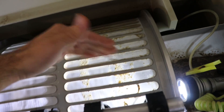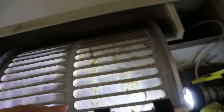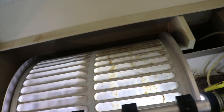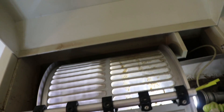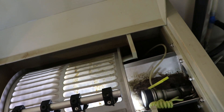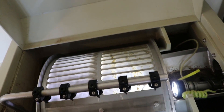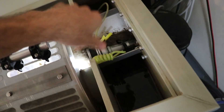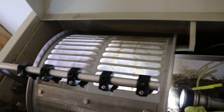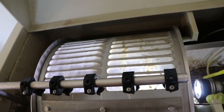This is the clean side of the drum filter so there shouldn't be any muck on it at all. The spray bar's working fine, it's just this stuff is so sticky it doesn't really spray off. Basically all I'm doing is every two or three weeks I'm just going over it with a pressure washer — rotate the drum a full turn, pressure wash it quickly, blast the pressure washer down there, let the drum do a few cycles and it's clean. It's not too difficult to do but I wanted to see if I could get it to do it itself.